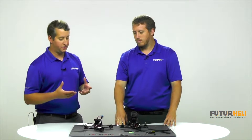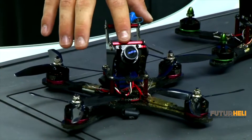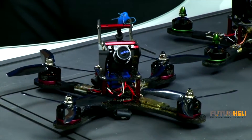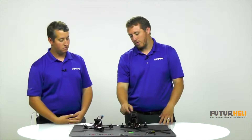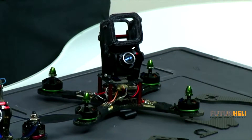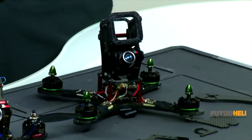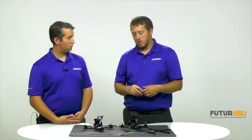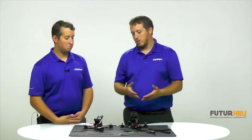One of the things I like most is really the camera tilt on this model — it's essentially unlimited camera tilt. It just mounts on the standoff here. The standoffs are 35 millimeters, which allows for any type of video transmitter. Also, depending on your skill level of building, if you don't have a really condensed hard-soldered setup, you can use connectors if you want. It'll be a little taller, but that way it allows everybody to do something out of the box.